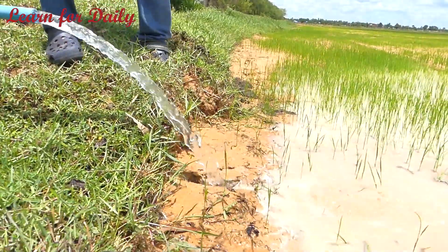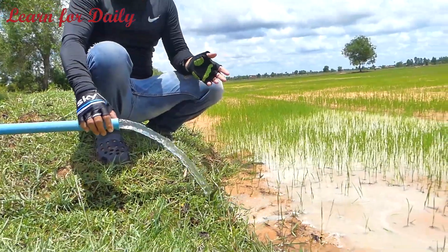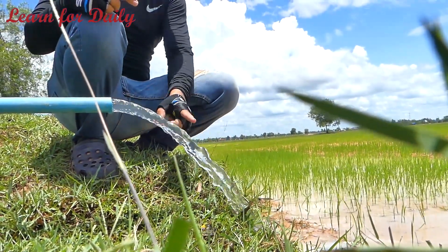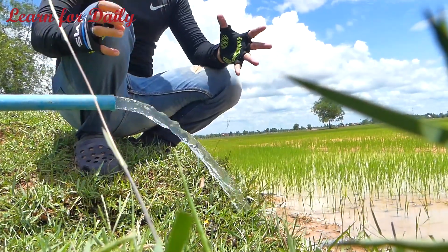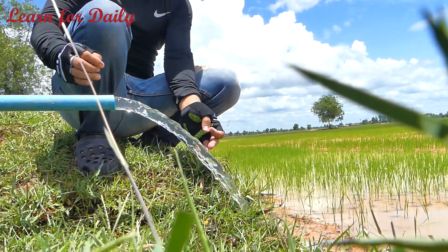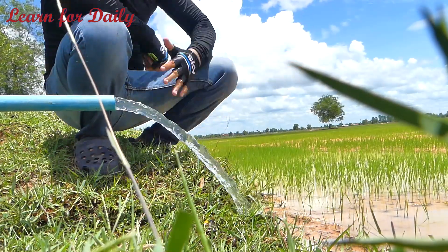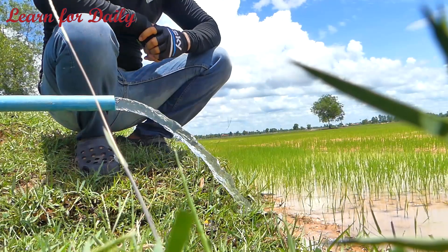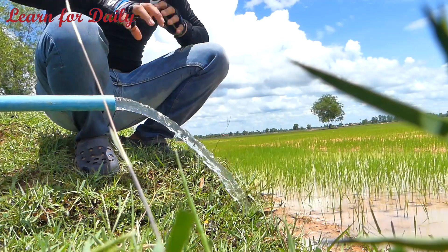Woohoo! It's one stop — I waited about 10 minutes there, and I'll wait here about 20 minutes. If it's still coming like this, it means it's sucking from the river. The water looks a little bit heavier now, because before it just pushed, but now when the water level in the drum is a little bit low, it tries to suck from the river — that's why it's a little bit heavier at the intake water pipe. So I'll wait here to observe this water for about 20 minutes, and also go see my rice field over there.